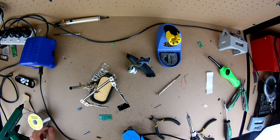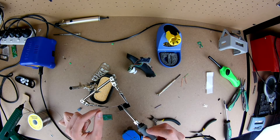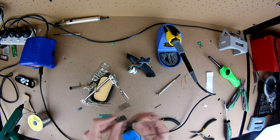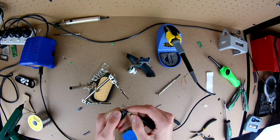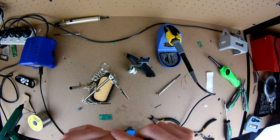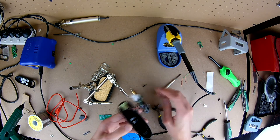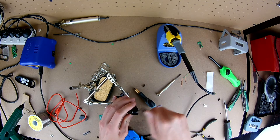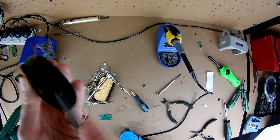Then it's time to prepare the NRF chip. Hit both of the solder dots on the back of the board with a hot soldering iron and a little solder to make sure those connections are solid — otherwise the interaction may not work. Wrap the whole section in tape, then use a very small flathead screwdriver to pry the standoffs off the pins so the chip can sit down a bit nicer. This also helps if you want to remove the pins and add your own wires. Also cut a small notch in the back of the case for the power wire using flush cutters, then sand down the rough edges so the wire can sit in there without being damaged.